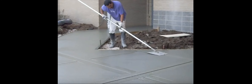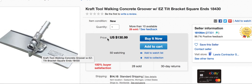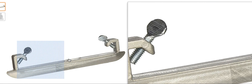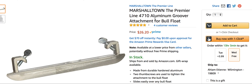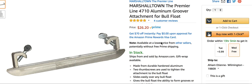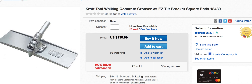Unless you want this — this is what this airplane groover will do. You can obviously come out and mag out the lines created on the outside edges of this. It's a nice concept and it has its purposes. Here's the brass version — this is the version I use. The magnesium would do the same thing; it keeps the pores open and you need the depth. I create one-inch joints minimum for four inches of concrete, and you're going to have to do the same with six inches — you're going to have to do the inch and a half. This radius here is going to be a tighter, less of a gap. They do have metal guys that create even less of a gap — I don't recommend them because it's steel and you're going to have to get on it too soon.